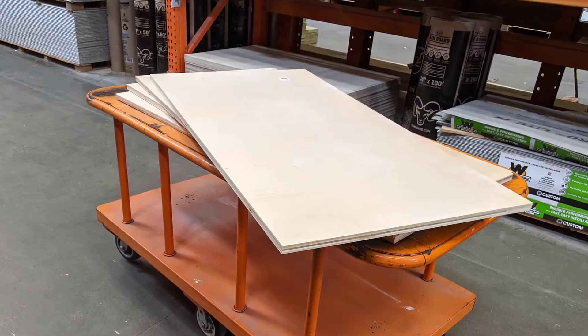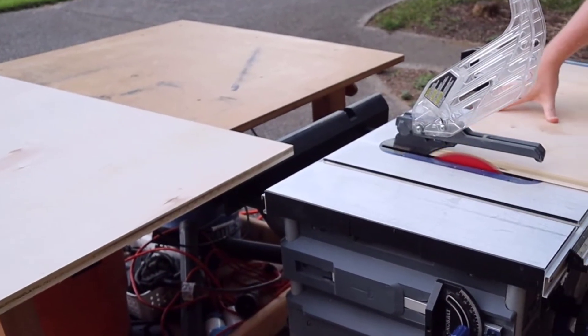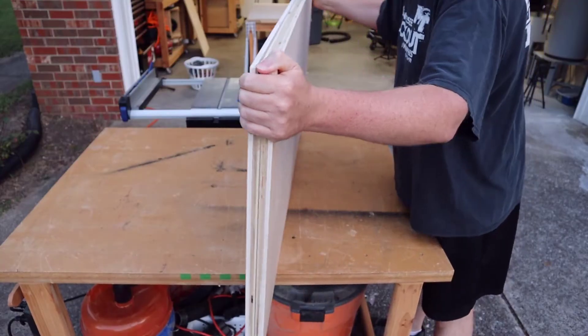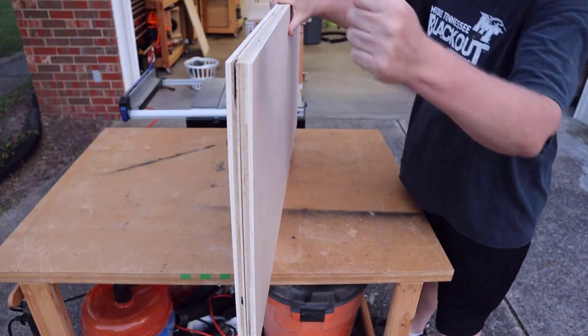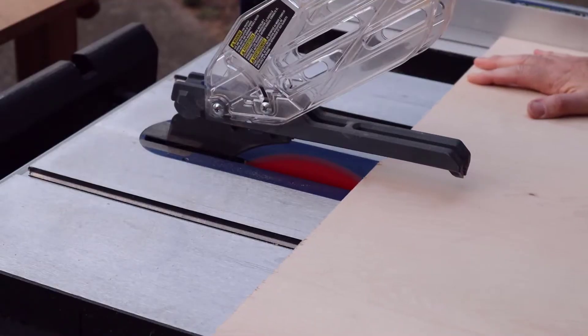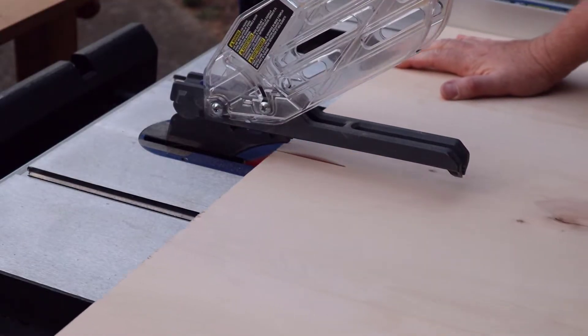Box construction is straightforward. I'm going to be using some birch veneer plywood to save on weight — this stuff's a lot lighter than MDF. What I like to do is have them cut it down to just slightly oversize, maybe a half inch bigger than the size I actually need, in case they make a mistake, and then I can cut it down to the final width on my table saw. In this case that was a smart thing to do because one of the pieces was slightly out of square. I ran that piece to the saw and everything came out nice and square.